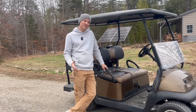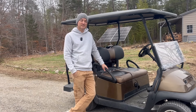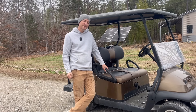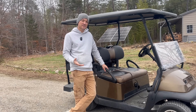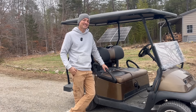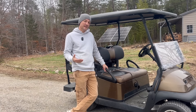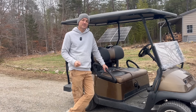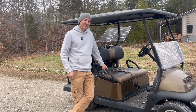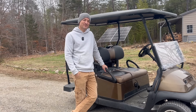As I mentioned before, it's going to be hard to beat the quality of this battery. Price-wise though, for solar storage this wouldn't be practical, plus the fact that charging is limited to 50 amps continuous. But for a golf cart it would be hard to beat. The one thing it lacks is internal heaters. I don't know how many people are going to be driving a golf cart in the dead of winter, but this does not have heaters. Depending on how the BMS is set up, it should still be able to discharge down to zero degrees Fahrenheit, but it won't charge unless you're above 32 degrees Fahrenheit.